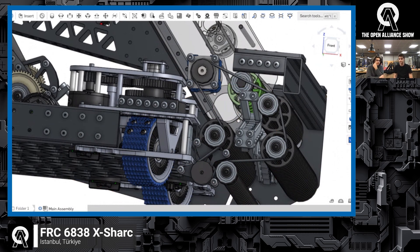We wanted to make it easier for the belts not to escape the pulley — last year, both sides of the pulley were open, which sometimes caused the belt to come off and affect performance. So this time we made improvements to our 3D printed parts. Similarly, we'd like to make a passive centering part for the intake, with bearings and shafts inserted during printing. We can actually show you that right now.